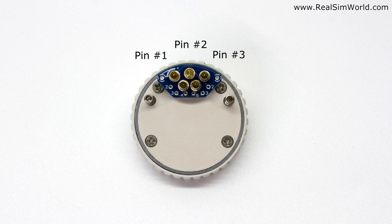The center pin on the top is voltage output. It is buffered with an onboard amplifier, so please don't short it with either power supply or the ground, or else you'd risk damage to the amplifier, which voids your warranty.